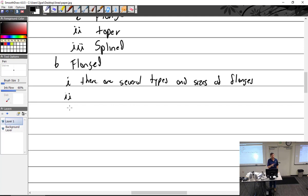So your only true way to fix it is to drill the holes in the prop. Yeah. I don't think you would get an STC, because I don't think anybody's spent the time, effort, energy, and money to create the paperwork to put the wrong crankshaft or engine into a 152. So your only option is to just disassemble it, put in a new crankshaft. Re-register it as experimental. Experimental, yeah. Sell it as a kit to the next guy. Almost complete, brand new engine. Here's the prop, I just didn't put it on.